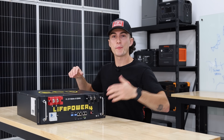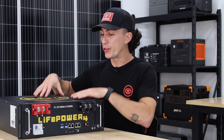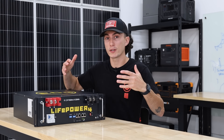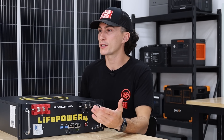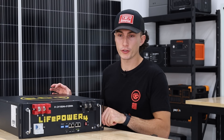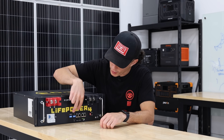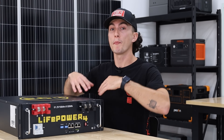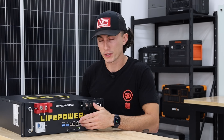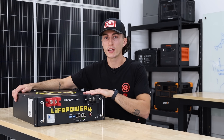On the plus side, this battery is one of the first to feature rapid shutdown, or e-stop. The upgraded communication allows it to not just shut itself down when it detects a problem, but shut down your entire system — which is apparently required for legal installation in California. We also like the upgraded communication ports and the expanded dip switches, which went from four to six positions and now support two different protocols, allowing you to build much larger systems and communicate with more modern, higher-end inverters.